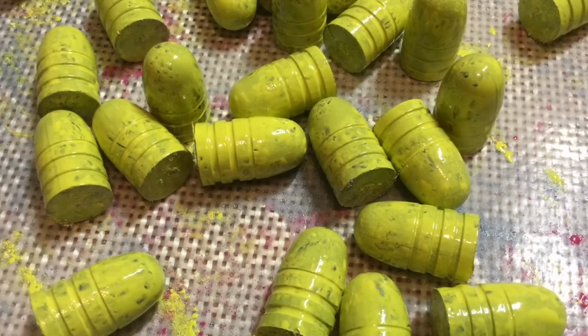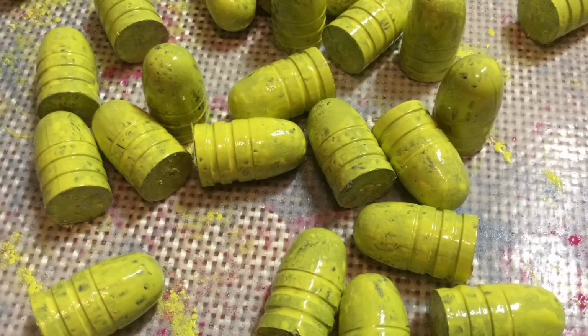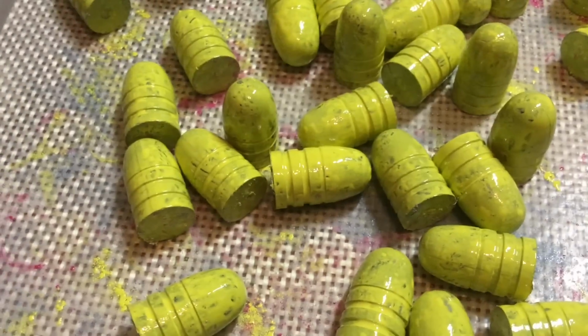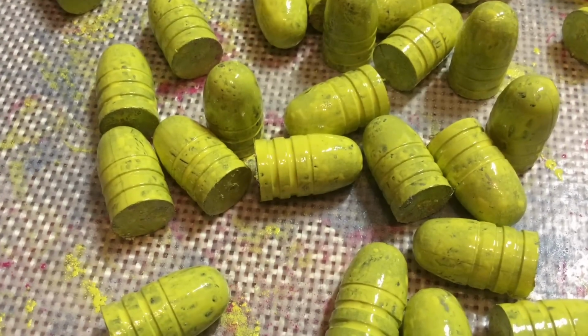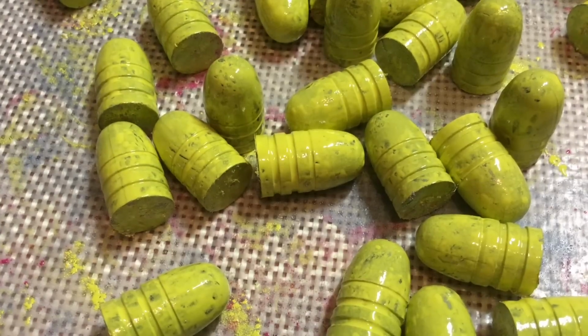anything that touched the bullet at all caused a loss of the powder in that spot. And then when you put it in the oven, the powder would not flow and melt together to make up for all those little spots that you touched it. Whether it would be with the tongs or contact with a wire basket, or whether the bullet fell over while you were putting it on its base, this kind of thing. Notice the one on the left has a little scratch there from the tongs, so that when you baked this, the powder didn't flow out and cover those areas up.